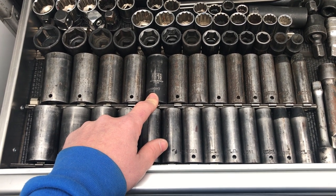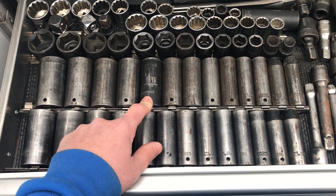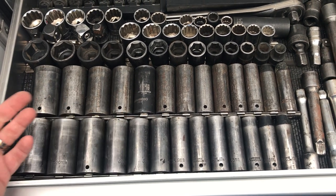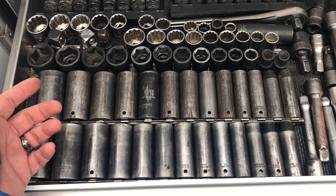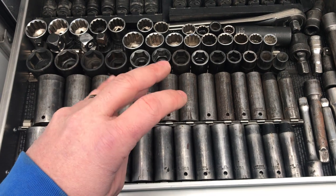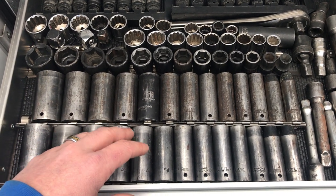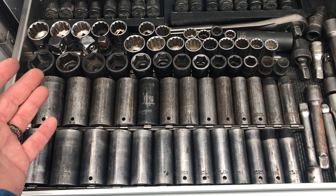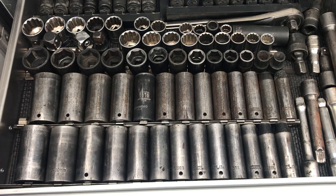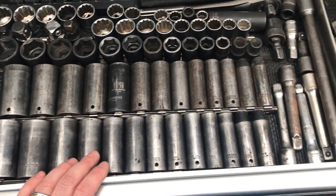I was rebuilding an apron feeder for a crushing plant, and instead of a conventional rubber track belt system, it used track pads from a 215 Cat excavator, and so we had to remove all those track pads that were all shot, and this track feeder was like 80 feet long, so there were several hundred of the track pads, and I just plumb wore the socket out.